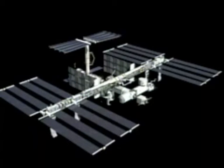It has thermal radiators which circulate ammonia through them and radiate the heat to space. Then this cooled ammonia goes back to the space station for air conditioning and to cool electronics. It also is a structural member that will hold the solar arrays, which will be the next step to add further outboard, and those will generate the electrical power for the space station.